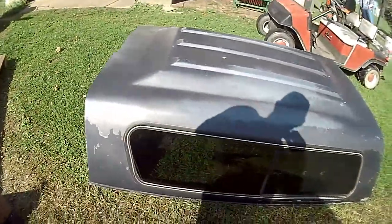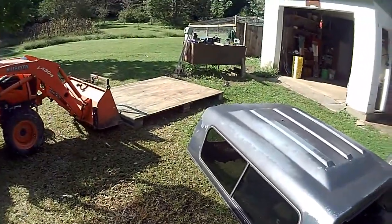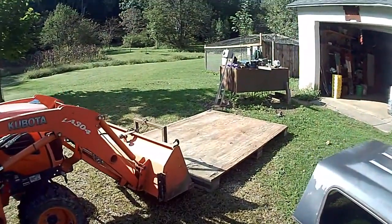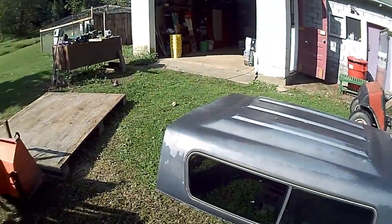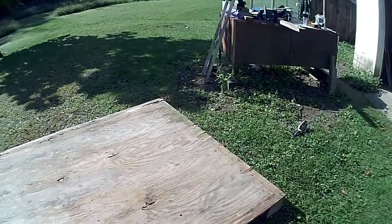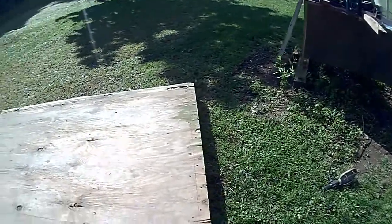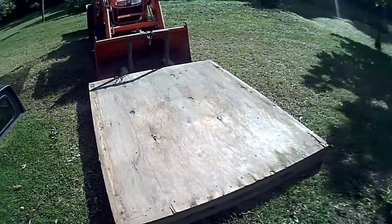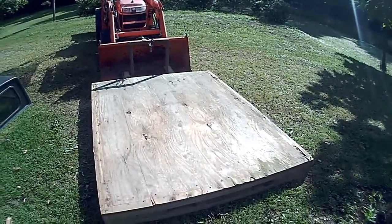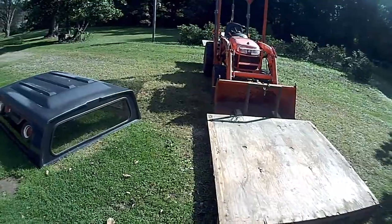I think it's going to produce a lot of its own heat because of the dark colored cap, and if it fails I guess my grandkids will just have a playhouse. Alright, I've got to cut two inches off of each end of this floor, and once I do that I have some treated skids I'm going to put underneath this to get it up off the ground, because this is all kiln-dried wood and it's actually been sitting out in the weather for a bit. So I need to do something with it or it's not going to be good for anything.